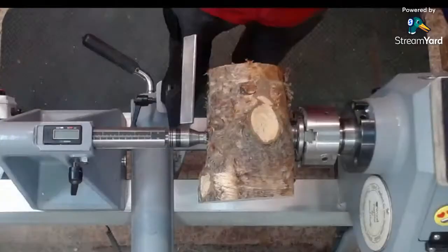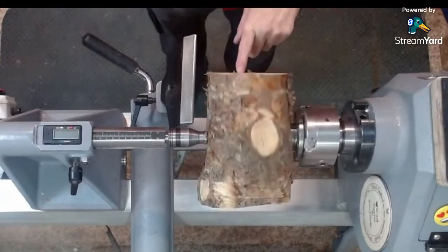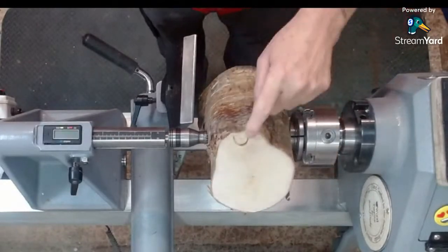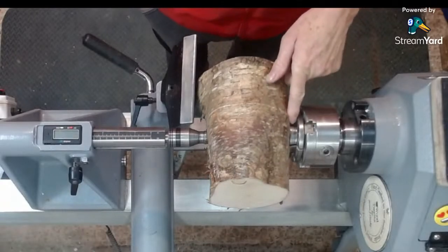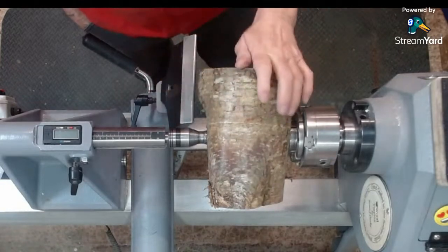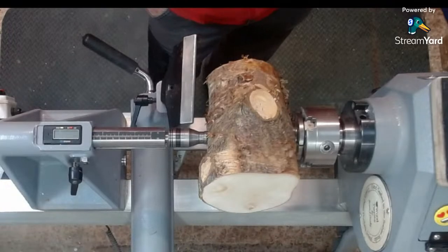So what we're going to do today — I'll put you back in the background and we'll have a look at this piece of wood that's on the lathe. It is a little piece of cherry. For those of you that don't recognise the bark, it has a few branch inclusions on it. I have it currently mounted on a woodworm screw, which is not my favourite way of mounting anything, but we're going for it today. Tailstock support. What we intend to do is make a natural edge bowl, globe-ish kind of thing.